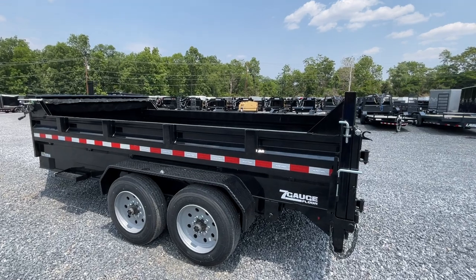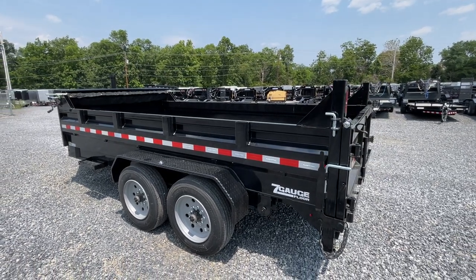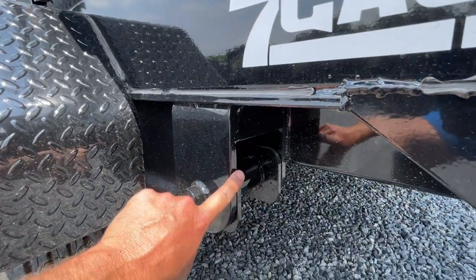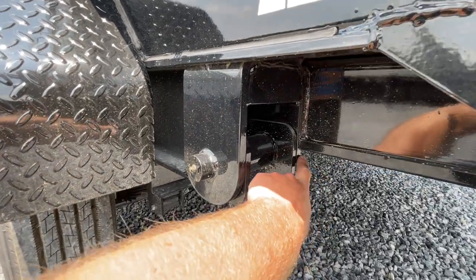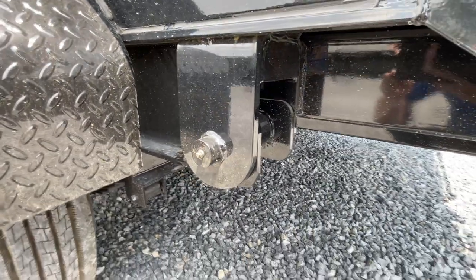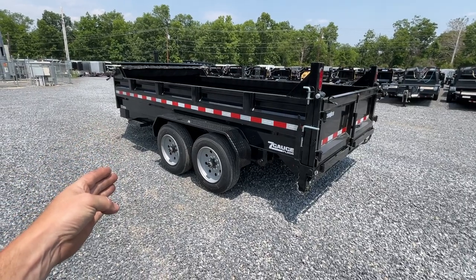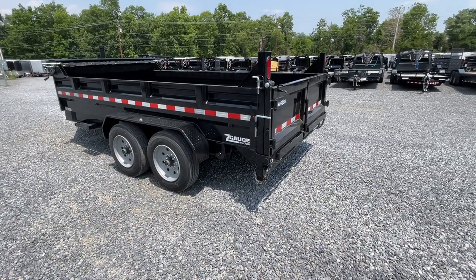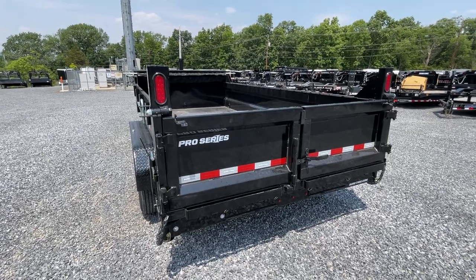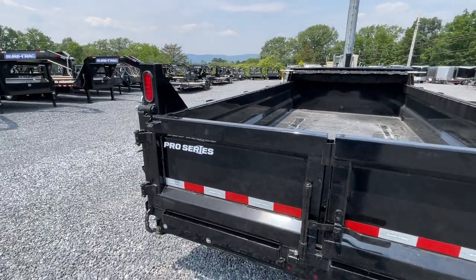When we said this is a heavyweight dump, it's not just any one thing — it's not just a reinforced floor. Short Track has done a great job reinforcing this whole trailer. This hinge is substantially heavier than what was on the old one. It is reinforced inside out, boxed in at the top, and it's also got a grease zerk on it. That's one of the things we really like about Short Track — they don't just have one item that's five-ton rated, one that's seven, one that's ten. They make sure everything is uniform, so if you have an abusive user, by the time something breaks, you can figure it was well past what it should have been doing.